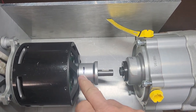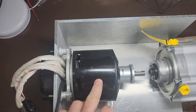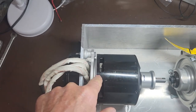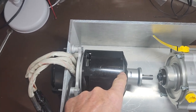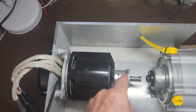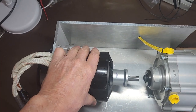I don't like all this wasted space in here. This free RC hobby motor is designed to run a propeller — a big propeller. This shaft runs all the way through the motor; there's a bearing here inside and a bearing here inside. So this motor is designed to take quite a bit of load out here. The screws for this thing are inside going this way and they're hard to get to.